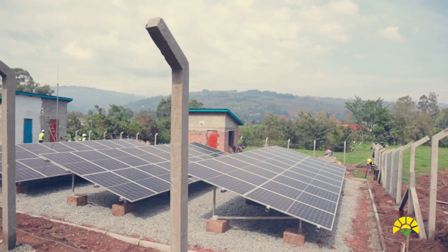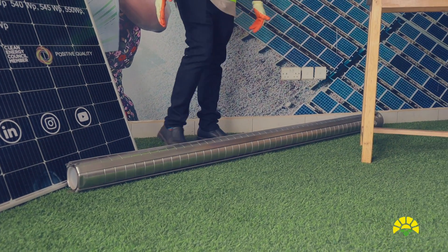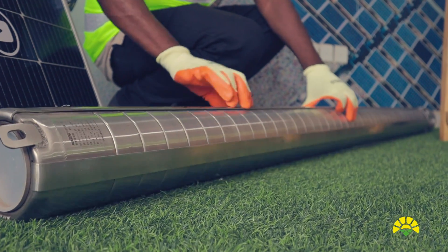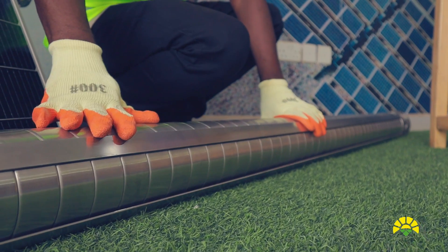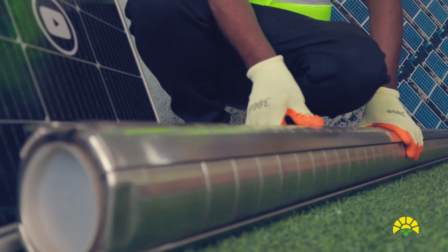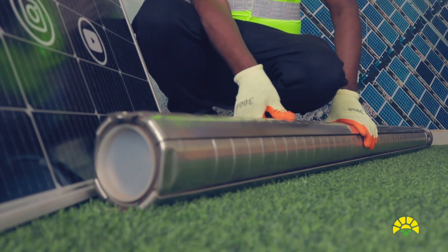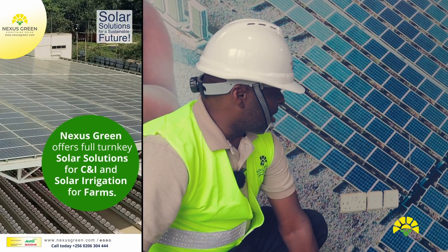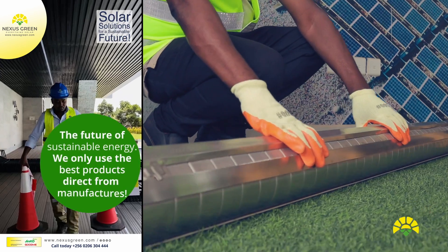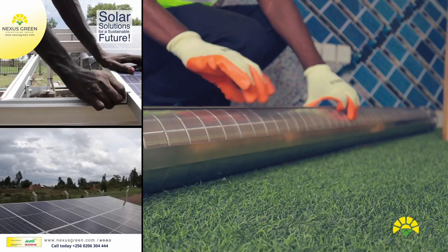We also have Jinko pumps. These are three-phase pumps. The Jinko pumps are able to offer us the duty points for the various water capabilities depending on the flow and the head. This submersible pump is 26 kilowatt. They are made using stainless steel and the impellers are modular.